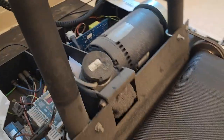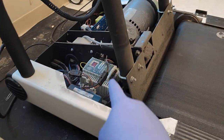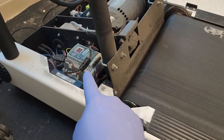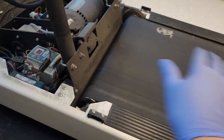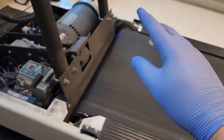Here's my elevation motor. The VFD could also be working too hard — there's usually a current limiter on there. If this deck has not been lubricated appropriately and you have a heavier patient on it, then the VFD is going to throw an overcurrent protection error code back to the computer. It will then lower the elevation motor and stop the three-phase motor, putting the machine down into the resting position where the patient can safely get off. That's the anatomy of the failure I think is going on — it really is just a lack of maintenance on this cardiac stress monitor.